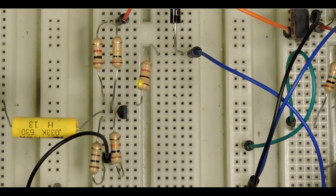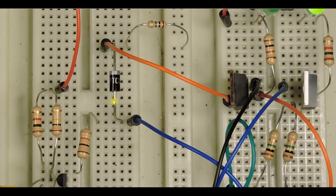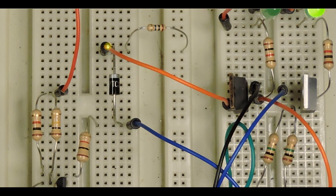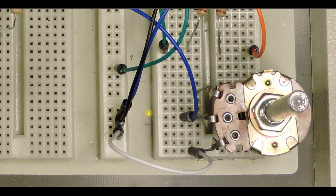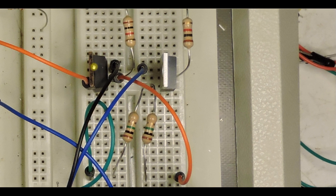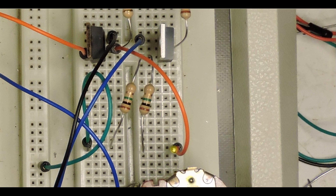We have another output — a 1000 ohm resistor going to a silicon diode. On the other side of the diode, this wire goes to the gate of the first MOSFET. This is our 10 megohm resistor, and this blue lead goes down to our variable resistor. Here are our two MOSFETs. The output of the first MOSFET goes through a 1 megohm resistor to the gate of the second, which also has a 1 megohm resistor to ground.